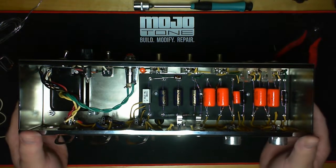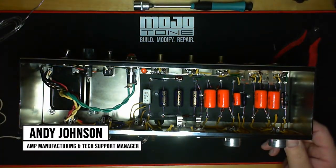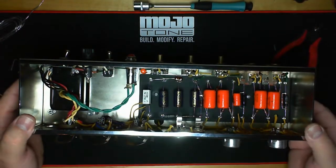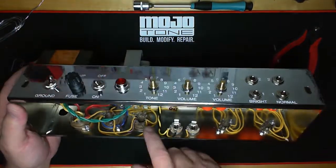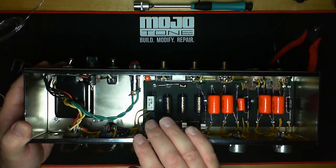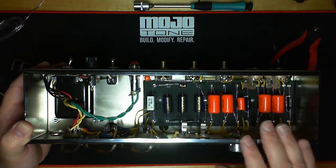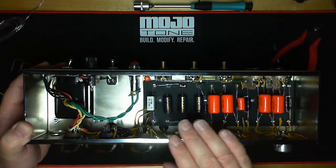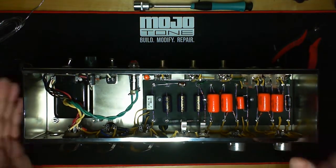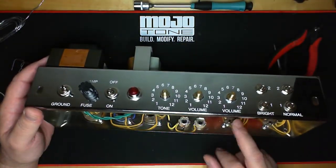Welcome back. We're in the final phase of wiring our amp. The next phase will be adding the 1.5k resistors as well as the 100 ohm resistors for the pilot light filament. The filament lines are the heater supply — the 6.3 volts — and I want to explain that a little bit. The filaments heat the cathodes in the tubes in order for them to work properly. I'm not going to go into the physics of that, but what's important is that you know what the heater supply does and where it goes.